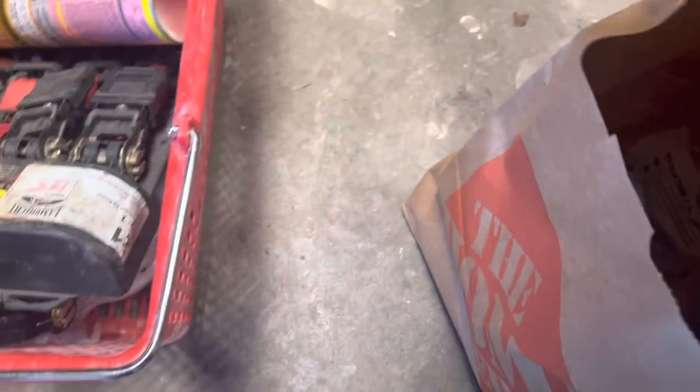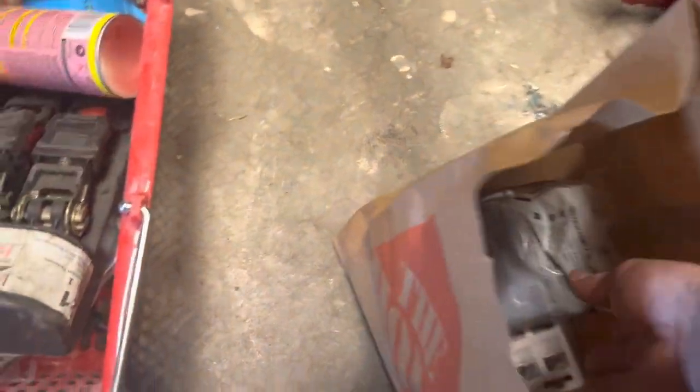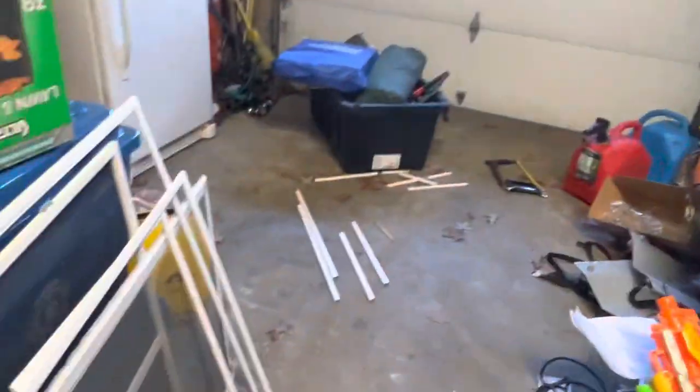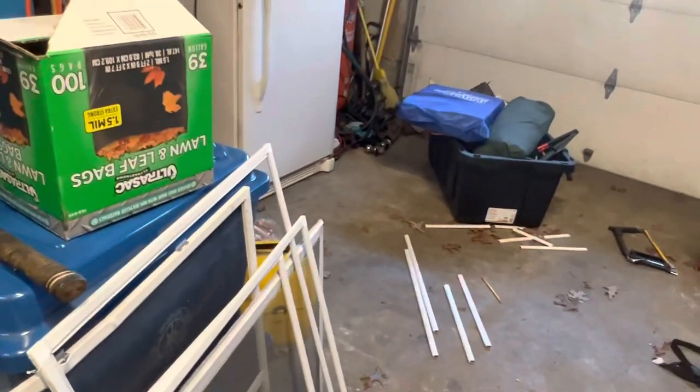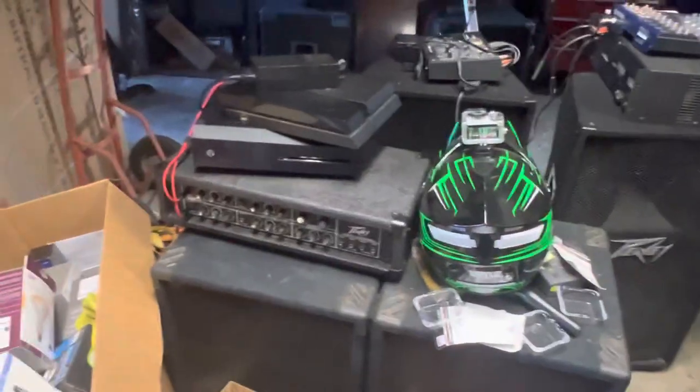It's easy to do — people, don't be scared of it. You buy these corner pieces, they're like two bucks each. Each frame is going to need four corners. Then you buy the spline — I'll call it the beading, but it's actually called spline. I've got a hundred feet of screen back there in the corner. I'm going to zip that all together. I don't need to bore you with the last part — maybe I'll make another video on the screening. Do me a favor: like and subscribe. You never know what you're going to get — sometimes trains, sometimes sound systems, sometimes quads and dirt bikes. Thanks!